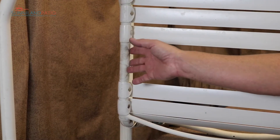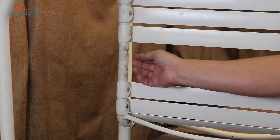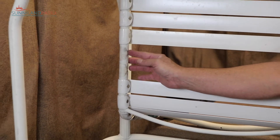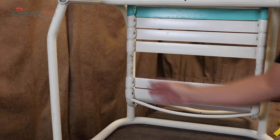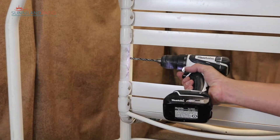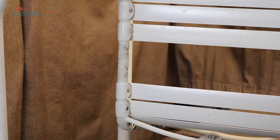These chairs already have the holes, but if your chair were adding a strap or didn't have holes, this would be the time to drill them. You would just do it on the inside, simply drill into the bare frame — or widen the hole if you were trying to put a different size rivet in there.